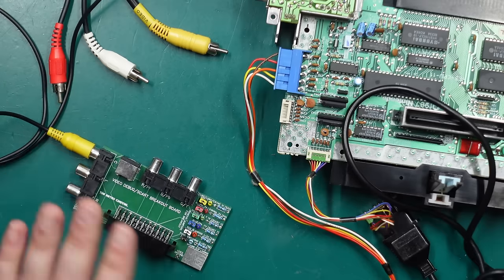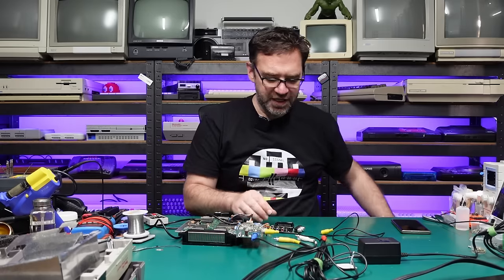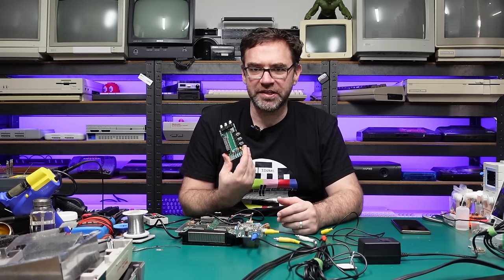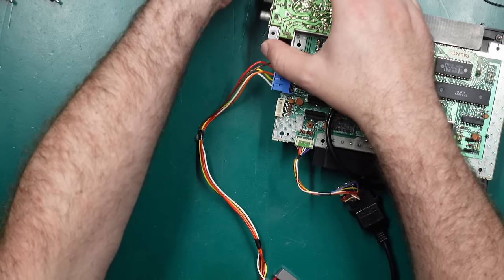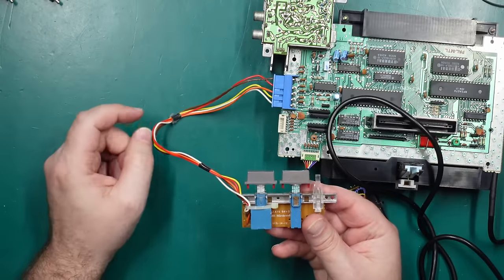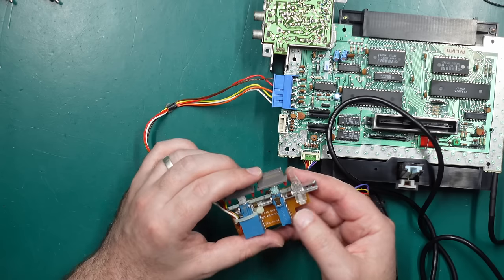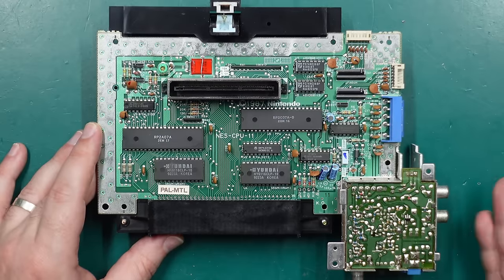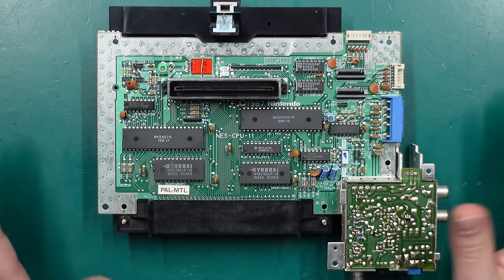We can now disconnect all this. The reason I like using this little breakout board rather than hooking it up directly to a display like the RetroTINK is because if I make a mistake and send too much voltage down the composite video line I'm only going to damage something on this board and not the RetroTINK 5X. Rather than trying to make changes to the RF modulator itself, we're just going to bypass most of the video circuitry and basically pull it off the main board and design our own little video amplifier.